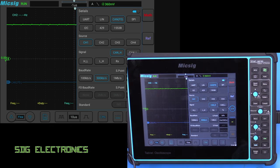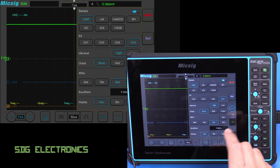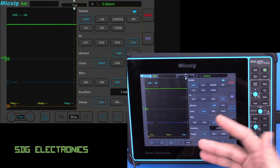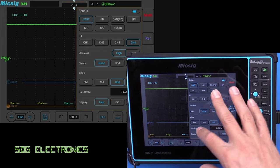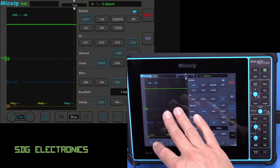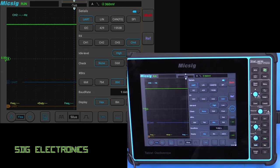So that's serial decoder one, and serial decoder two is exactly the same — an exact replica. You can even decode the same channel at a potentially different baud rate, for example if you were switching baud rates during communication, which can be quite handy. You can completely independently decode another channel, and you don't even have to have that channel displayed on the waveform — you can turn the channel off from being displayed and it will still decode those numbers in the background.